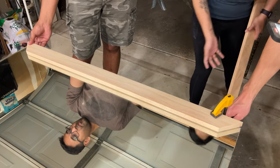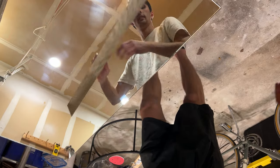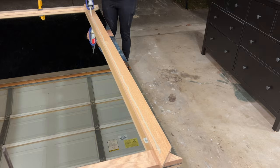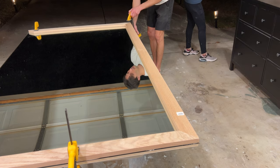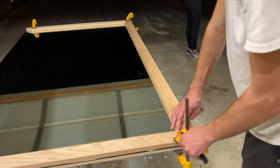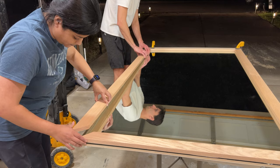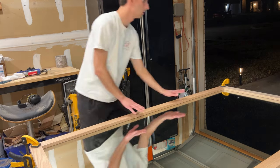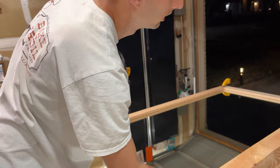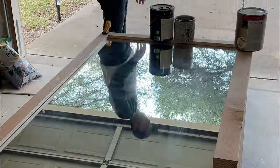We chose a two-tone design: the inside trim is natural wood oak, and the outside piece we wanted to paint black. To save money, we only bought nice oak wood for the inside part and used pine for the sections that would be painted black — pine is so much cheaper. We used 1x3 oak boards and 1x3 pine boards. To attach the oak pieces to the mirror, we used that same mirror glue, and we weighed the trim down while it dried. One major tip: don't put the glue too close to the edge of the trim, because you can see the backside of the trim reflected in the mirror, and any visible glue won't look good.